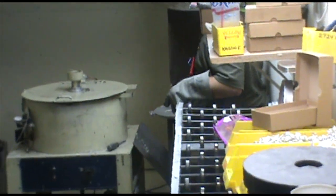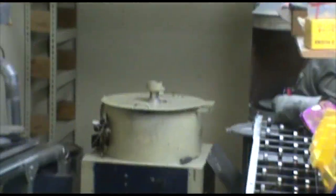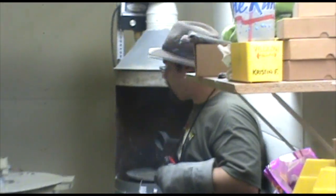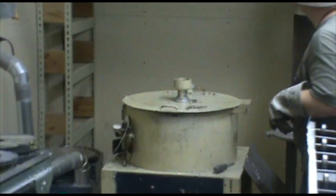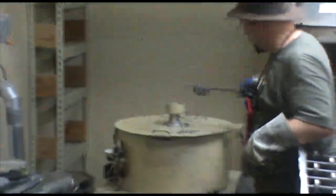We're running right now at just about 700 degrees. At 700 degrees, can you see this, Mark? Yeah, you're good. All right. At 700 degrees, our metal flows and pours just like water. It will splash like water, and it will leave a mess on your countertop like water. It does have a few advantages over water, and it's a lot easier to clean off. The one thing, it freezes at 350 degrees instead of 32.